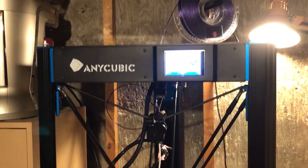The first thing we have to say about the Anycubic Predator is that it's a Delta printer. We've talked about CoreXY printing where the bed moves down and the head moves back and forth. We've talked about Cartesian printers where the bed moves back and forth. With Delta, the bed doesn't move — it's always at the bottom and the head swings the hot end around to build the model up.